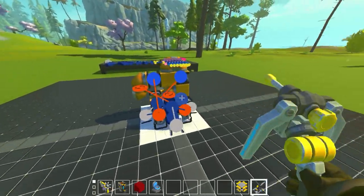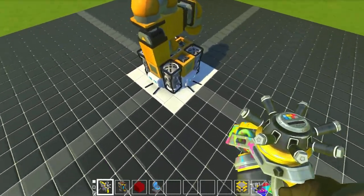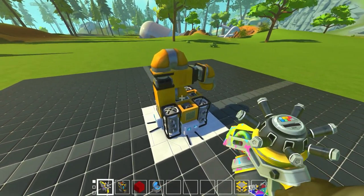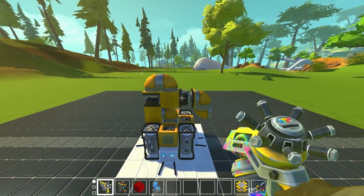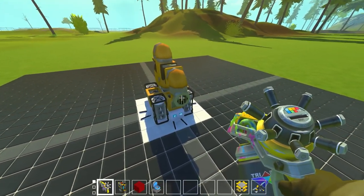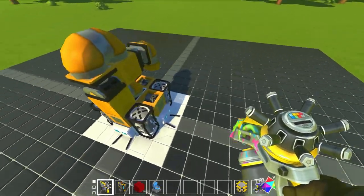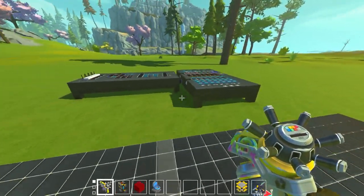This robot is a three-axis robot and it's a self-contained unit. We've got it on a nice tile background so we can see the coordinates, and it's got a white base with stepper motors and RC connections. It receives all its information remote-controlled with just four connections — one for each motor. It can rotate about its center point, has a piston that extends up and down, another piston that extends outward, and a rotation point on the very end piece. The robot is not allowed to move within the white square — it only operates outside of it.